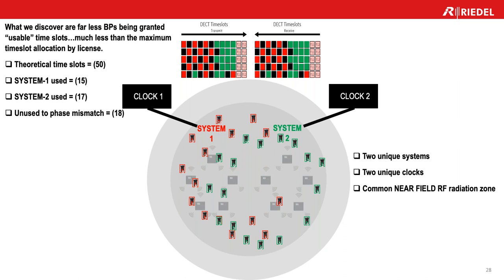Does having one of your antennas licensed as a standalone give you any advantage in using it as integrated? There is a caveat. You can mix in integrated mode, because a certain level of negotiation, audio mixing, and data recognition in the integrated system is handled by the Artist matrix and not by the antennas. You can mix what's called generation one and generation two antenna hardware in integrated mode.